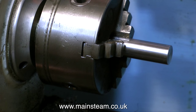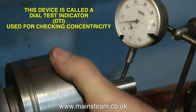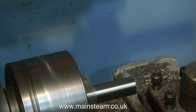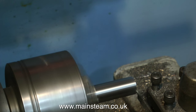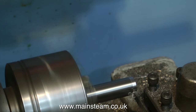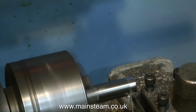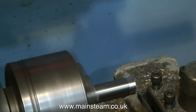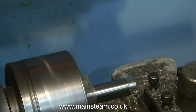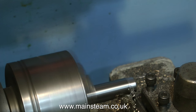Over now to the lathe for a bit of routine turning. I must stress that normally for making a crankshaft like this I would use my collet chuck — I have a rather large, very expensive collet chuck — but I'm presuming that a lot of people watching this do not have such a thing. So as you've just seen, in my three-jaw chuck on my little Boxford lathe, which actually is very accurate, I'm checking with a dial test indicator the concentricity of the part in the chuck. Even though the chuck is accurate, the part must not be taken out of the chuck until the final size of the smaller diameter is reached. Don't take it out, try it in the work, and then put it back, because it may not run 100% concentrically. Some chucks are worse than others — this one, luckily, is very good indeed.